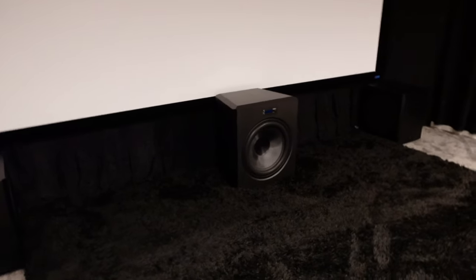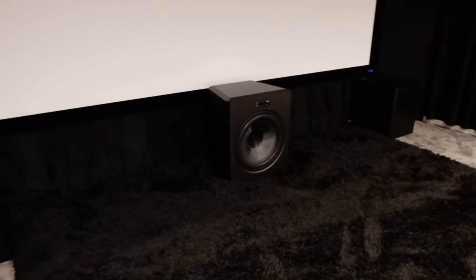So I set this up where I was running the Arendals straight face out, right at the edges of the rug there. I actually kind of like this better aesthetically. It kind of extends the blackness and it gets the Arendals more outside the field of view of the screen. And they seem to measure about the same. Quite honestly, in Anthem ARC, it doesn't really seem to make much of a difference whether I put something farther to the left at the quarter point or the middle. Stuff in the front wall tends to generally perform the same and generate the same kind of response curve, or very, very close to the same response curves, regardless where it's at in the front wall. So that position is far less critical. And I put the Harbottle in the middle because, of course, it's the single one. So it made sense to have the two symmetrically set and put the Harbottle as an individual in the middle.